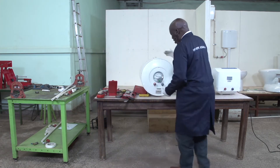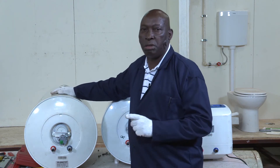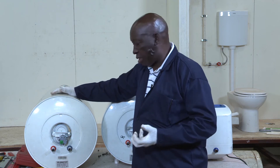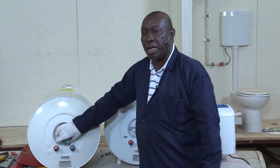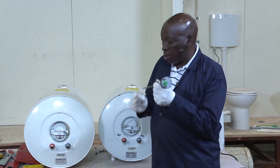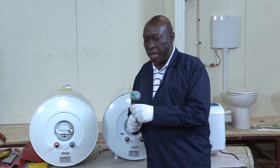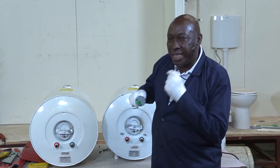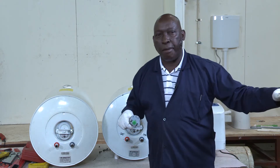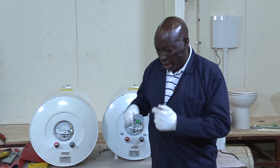Something else important in what a hot water cylinder does is temperature control. Because the moment you are heating your water, you must know which temperature to heat it to. We have what we call a thermostat. A thermostat is the item that controls the temperature of water, and this is adjusted by the user. What we have here is the thermostat — it has its own provision in the immersion heater and controls the function of the immersion heater. You have the adjustment here, indicated from cold to hot. You set your temperatures according to your needs — for example, 40 degrees for a shower or 80 degrees centigrade for kitchen water.